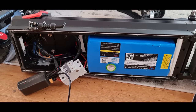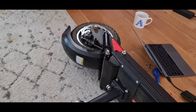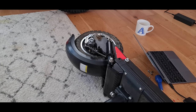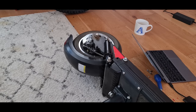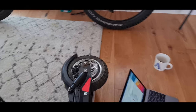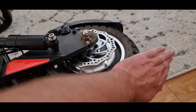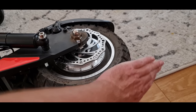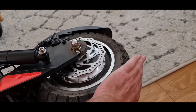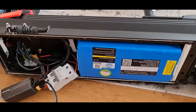So just got to stick it all back together now. So you can see what I mean by the braking — if you just push the throttle, it'll start to go, and then you take your finger off. Normally that would actually carry on spinning. There you go — see, it's got almost like a braking force. And you can feel that braking force on the actual motor itself. If you try and move the wheel forward, you can hear that high-pitched noise, and it's difficult to turn. Other way is fine, because obviously it's only kind of one way. But that's your regen braking force. I've set it to 35 amps.